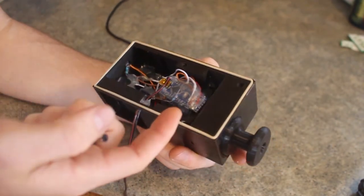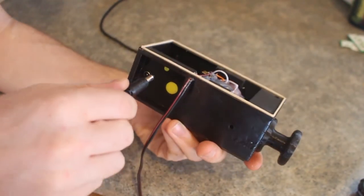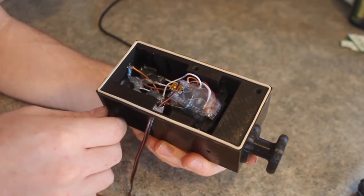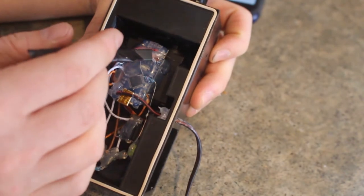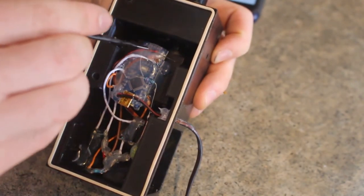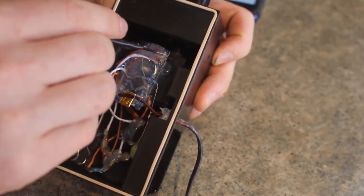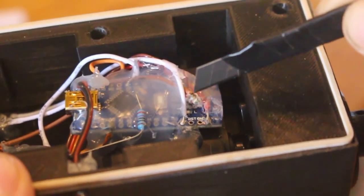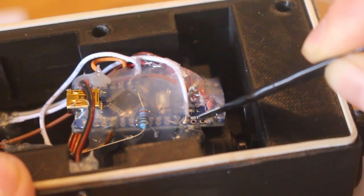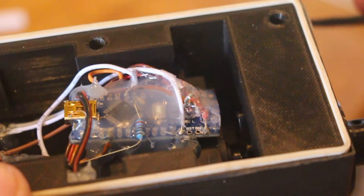So we've got to take it back off the wall and see if that's the issue. I brought it inside, plugged the Arduino in directly, and it actually started working — you can tell because there's a red LED right on the Arduino and then the servo rotates a little bit. But the connection was very intermittent and unpredictable. At my suggestion, Brendan considered that hot glue might actually be conductive enough that it's shorting between the power and ground pins. So I'm going to try to separate where he's got this glued together — the power and ground pins are unfortunately right next to each other. I'm pretty sure I figured out the issue and I think it comes down to the worst soldering job in the world made by Brendan. There were three wires supposed to connect to the ground pin and they just popped off as soon as I cut the glue off. I'm going to try to re-solder them and see if that helps.